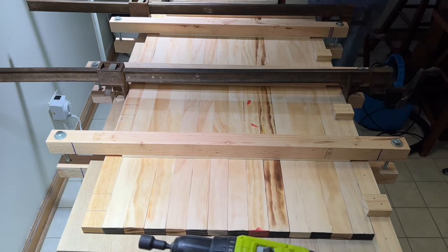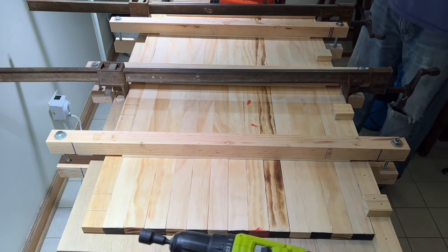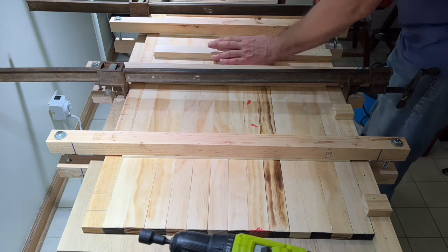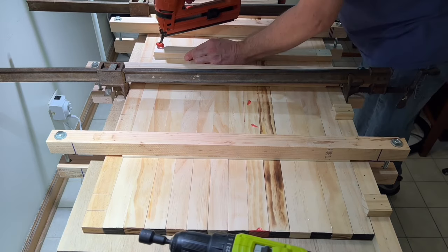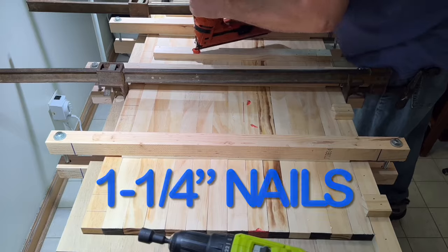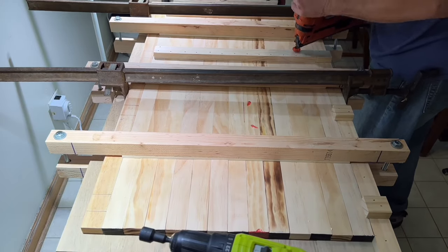This is where those 4 boards that we cut at 19 inches earlier come into play. I know I'm off camera on the first board, but you'll see the other 3 being put on. The board itself, like I said, is 19 inches. The flag is 19 and a half. So I like to center them and I leave a 1/4 inch gap on the top and the bottom. I am also adding wood glue to this. Sorry, that's off camera.